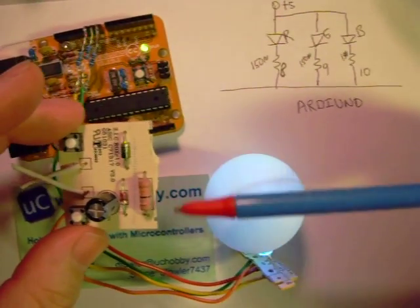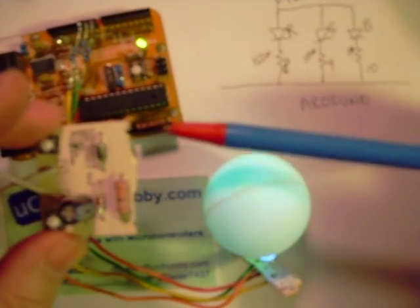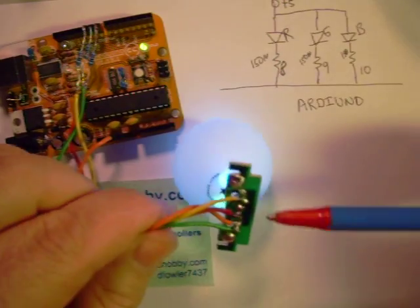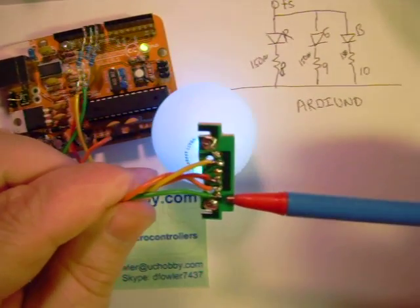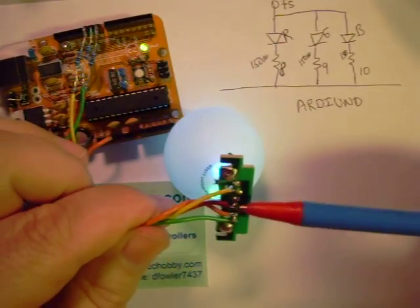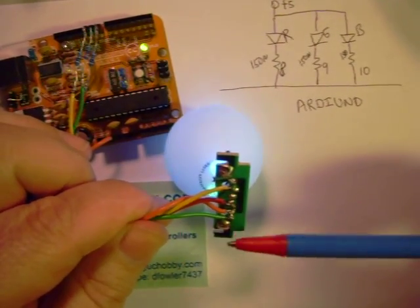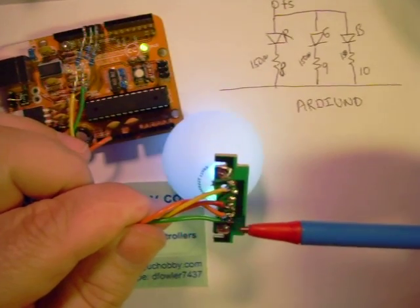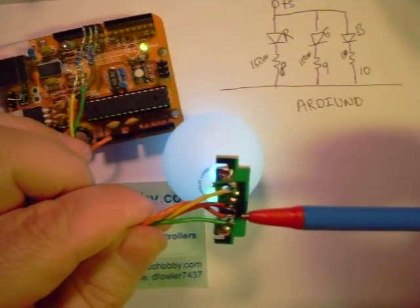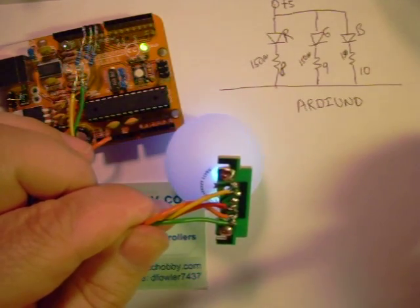There's also a big power resistor here that acts as a heater to heat up the oil on the air freshener. I've removed that resistor, and then I just soldered wires directly to the back of the piece of circuit board that was left over. I didn't have blue wire, but I had red, green, orange, and yellow — and I used orange for plus 5 volt power and yellow for the blue LED.